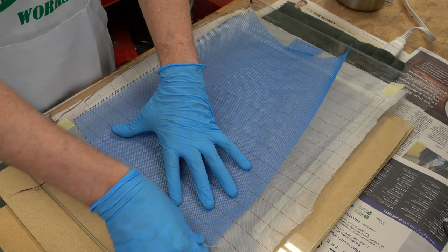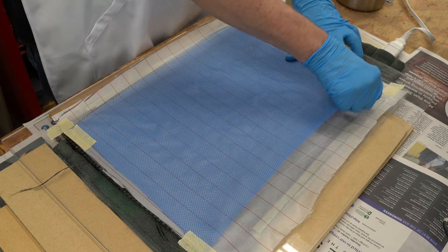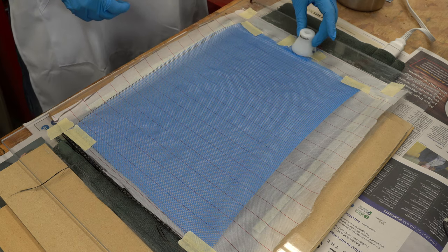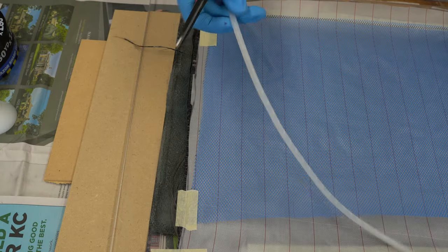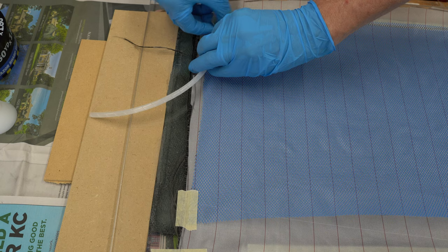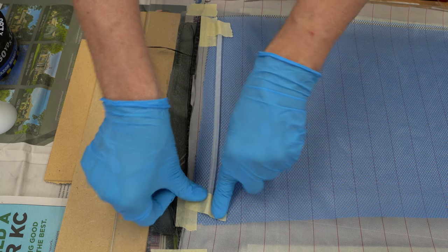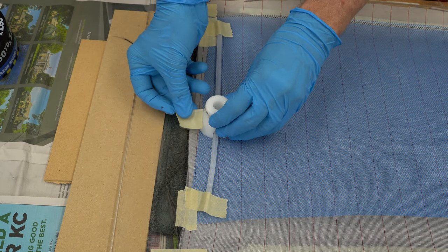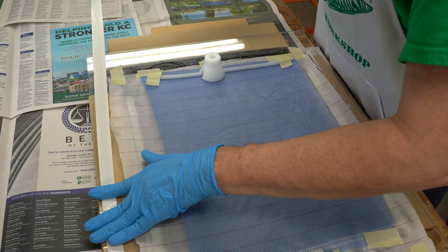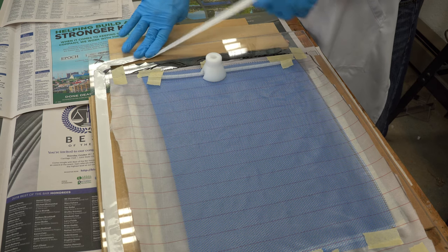The flow media has a lot of curve to it and likes to roll up, so I'm taping it down so it won't cause issues when I'm putting down the vacuum bag. The vacuum port is on the edge that has the wide peel ply with no media on it. The spiral tubing runs all along the front edge of the flow media to allow the epoxy to run into the front edge of the flow media, and I hold it down with a little bit of masking tape. The resin infusion port goes right over the top of the spiral tubing. Now we put down the sticky tape all around the outside edge of the peel ply, making sure we don't get any fibers from the carbon fiber or peel ply underneath the sticky tape.